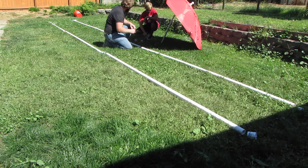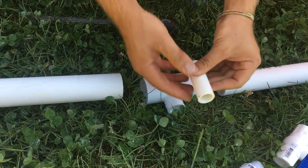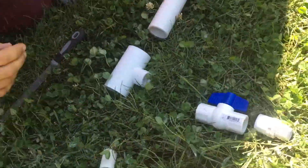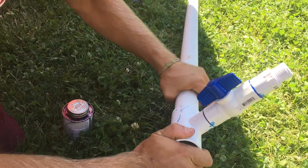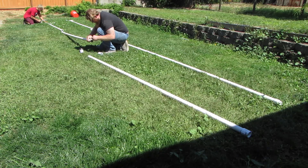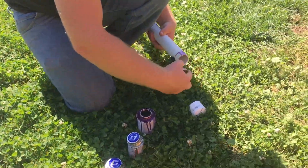Just measured right there to place the first T. This is user preference — put it wherever you want. I'm putting my first T in the front yard and the second T in the back yard. I'm using three-quarter inch pipe to connect the valve to the T. Please don't use a hacksaw to cut a three-inch piece of pipe like I am — I just couldn't find my pipe cutters. The T has a valve that goes to a three-quarter inch male fitting. Just a reminder: that is hose pipe thread, which is different from regular male pipe thread. Make sure you get hose pipe threads for a proper fit.